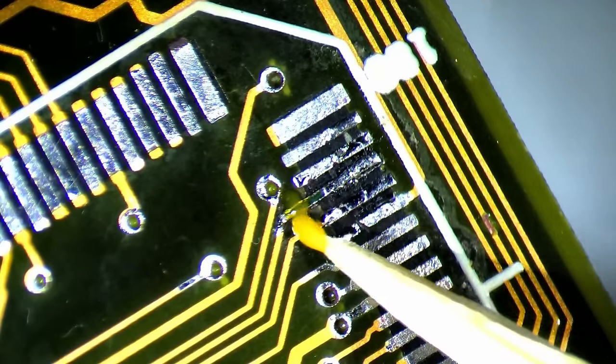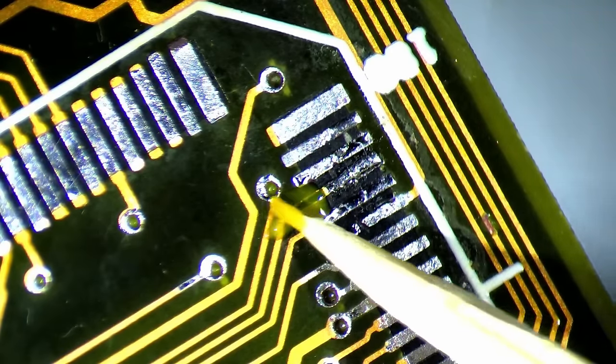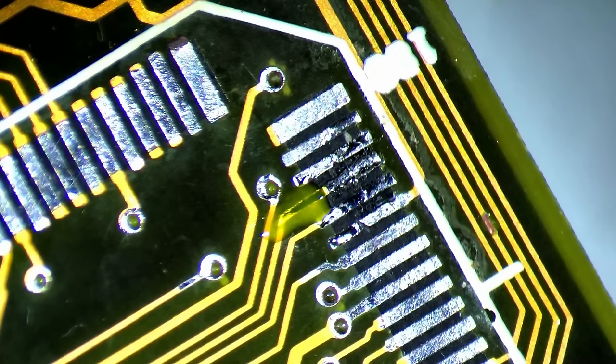The solder mask will keep the donor pad in place when we solder the ASUS chip back to the motherboard. And since this method worked so well, I used it to restore a second pad for one of the SMD capacitors.